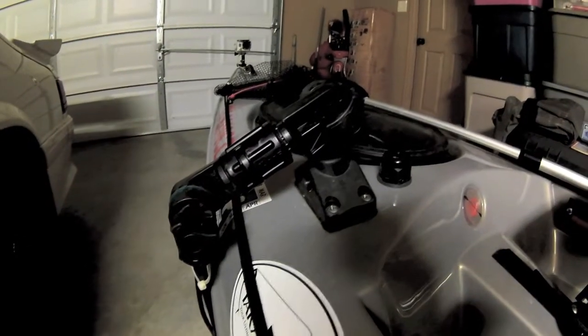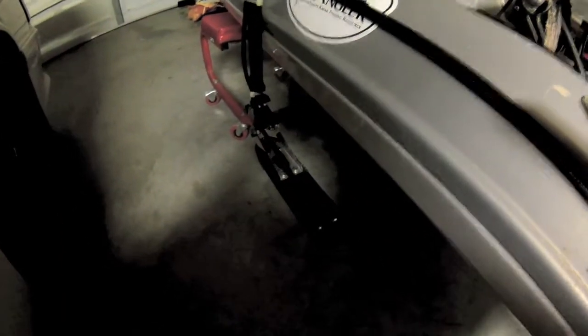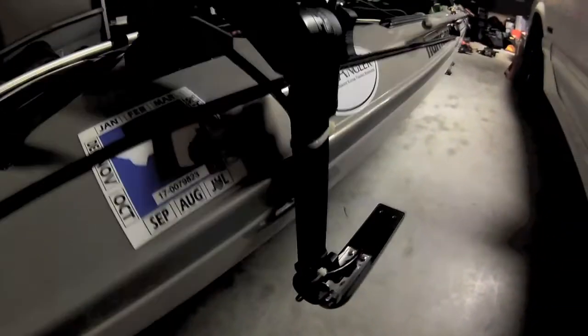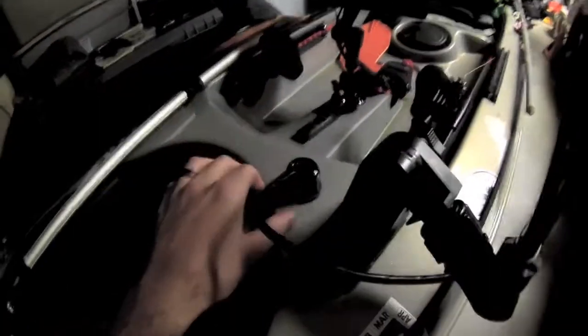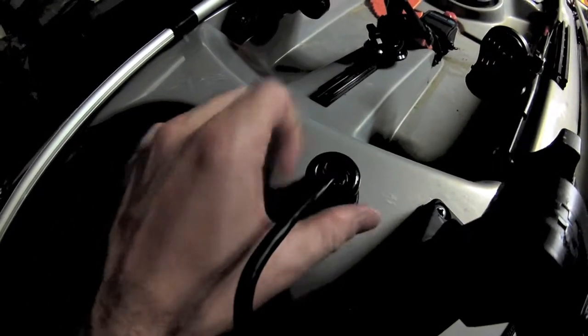For the fish finder setup I've got my homemade Scotty transducer arm — Scotty has since released their own transducer arm so I'll be upgrading shortly. This is a Garmin side-view transducer; it's quite large but sits just right under the hull so the side scan can shoot side to side. It's got side scan, down scan, and traditional sonar. I can bring it up and lock it in place with the slip disc. The through-hull mounts came from Hook One, siliconed at the top to be completely waterproof.